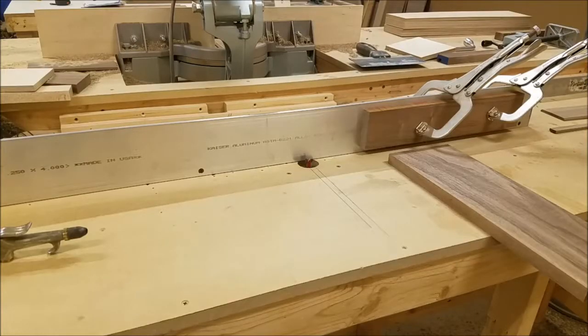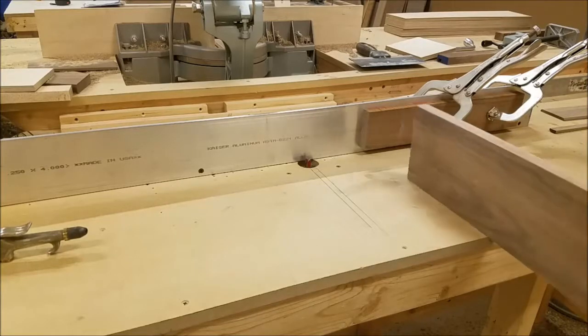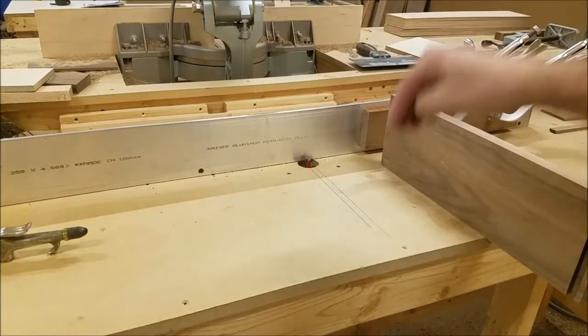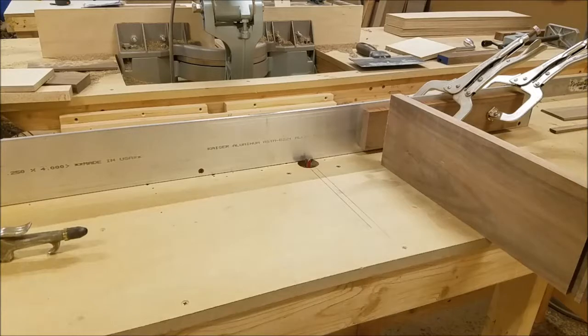Okay, I'm going to go ahead and run the other side of the dados for the drawers. And this side is not much fun. The reason is because I've got to make a plunge cut. And to do that, it's really nice if you have a plunge cutting router bit, which basically allows you to cut as you go. In other words, as I drop the board onto the blade, it'll start cutting. Unfortunately, Baltic birch is a little bit narrower than the half inch that it used to be. Now they've dropped it in thickness ever so slightly. The problem is that I can buy a router bit that thickness, but I can't buy one with a plunge bit. So what I have to do is muscle the board onto the bit and then run it. Once you've got it plunged, the rest is a piece of cake, but the plunge part of it is no fun, and you'll see that process now.